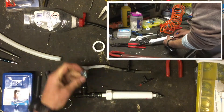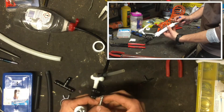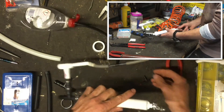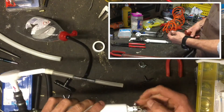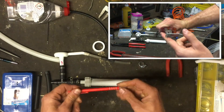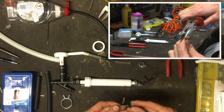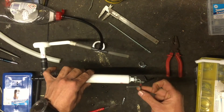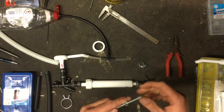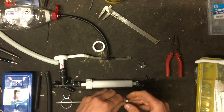The assembly on the end is super simple. It's just a piece of threaded bar, or you can use a bolt — for this one I've used a bolt, just cut off, with a washer on there, all held in place by a jubilee clip. You want about an inch or so of threaded bar sticking out. Onto that I've taken a small section of wire, made a loop in it, then a little pin, and that little pin is holding a spring — just out of a standard pen. We're looking for the lightest spring we can possibly get our hands on. I've got a nylock nut on this one, though I tend to start off using just a standard nut so they're easier to adjust, then swap it out for a nylock when I'm happy with how the pump is running.